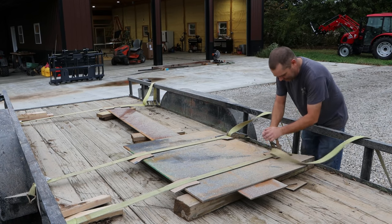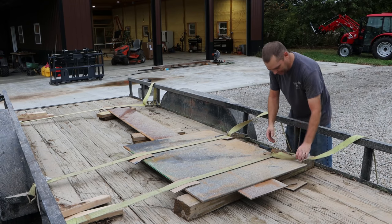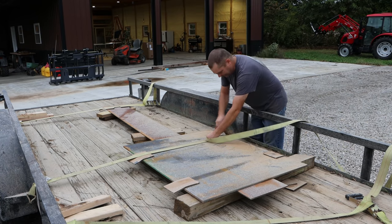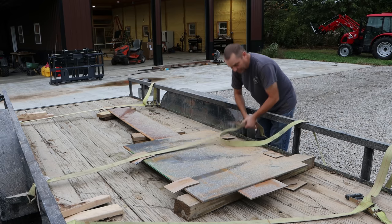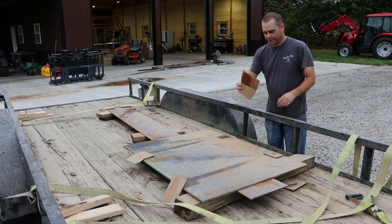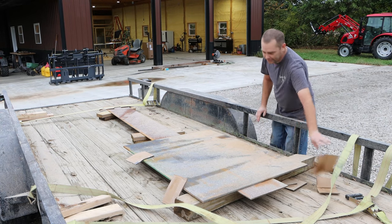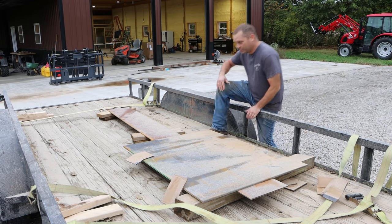It's been somewhat of a rainy day today and all this steel got splattered with mud as I was driving it home. We put the plate on with a fork truck and kind of slid it off and laid it down. With this steel plate I was afraid I'd cut the straps, so I ended up using some pieces of cardboard as softeners. You can see it actually cut right through that cardboard — so it's a good idea to at least soften those straps somehow so you don't cut one and have it break while you're driving down the road.